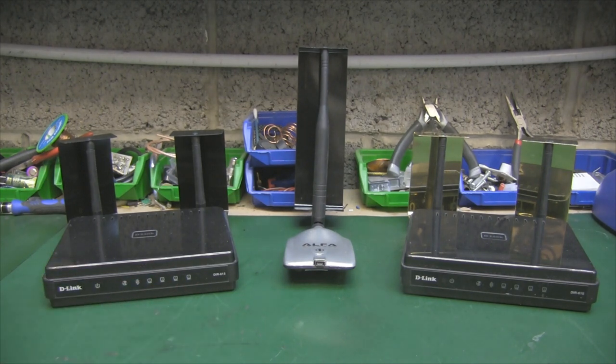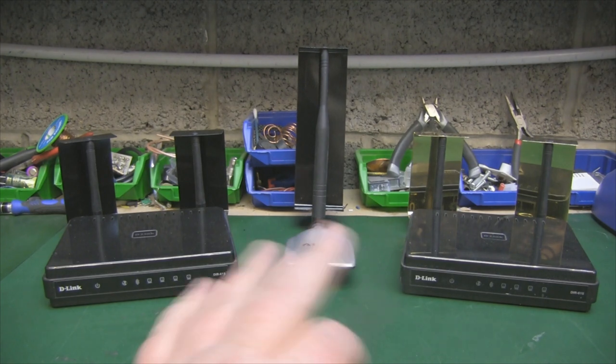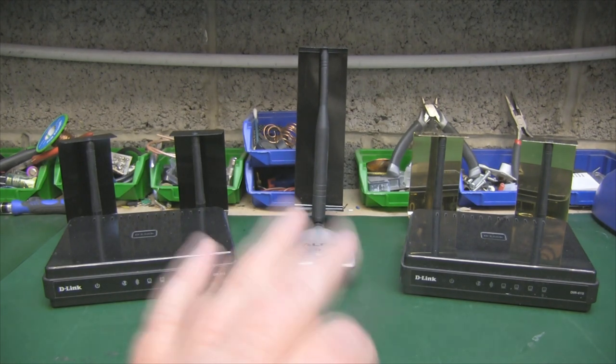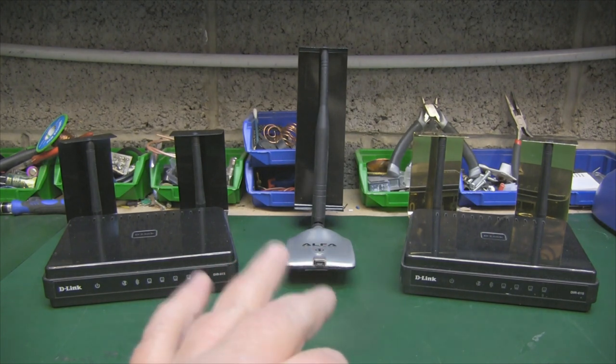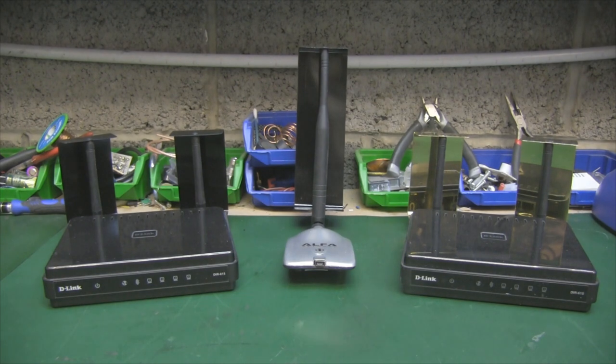I hope you enjoyed this video — it just goes to show that a simple hack like this can really improve the signal strength of your router. You don't have to get in there with a soldering iron or remove screws; just a simple hack like this can improve signal strength by up to about 50%. I've made a couple more reflectors since with better brass — the unpainted brass ones look great — and the one in the middle is made for a 5 dBi dipole antenna, made exactly the same way but with a longer overall length. You can make the holes at the top a little bigger if your dipoles are fatter, but they do tend to be a standard size. Any questions, drop them below, and if you enjoyed the video please give it a thumbs up.